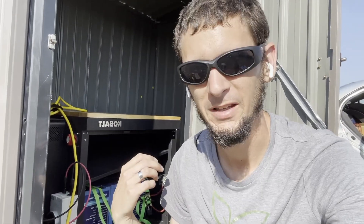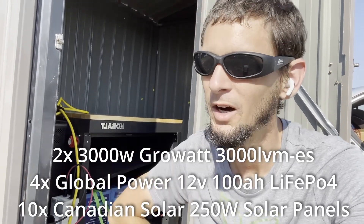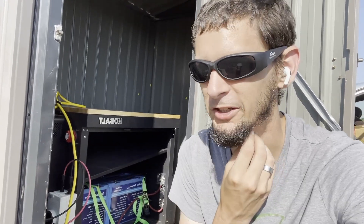So this morning's a fun one. I built this cabinet for someone — it's got the batteries, the inverters on it, does 240 volts, 6,000 watts, and it's got the panels up in a building over here. It went offline with no power yesterday. He hooked a generator up to it, which should have been able to charge the batteries going to bypass mode, but it still wasn't charging the battery.